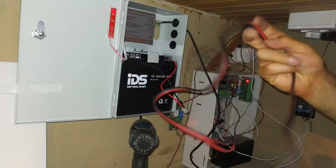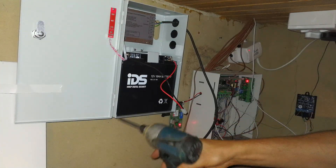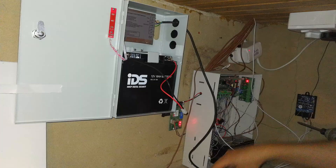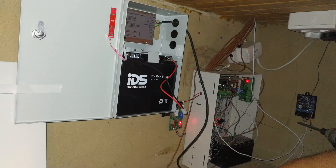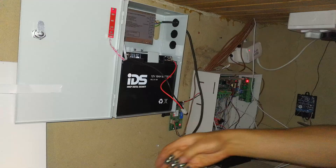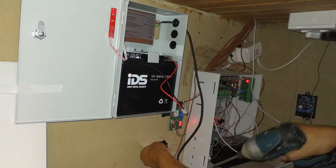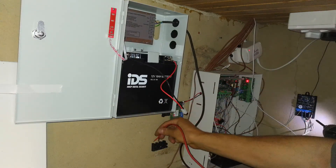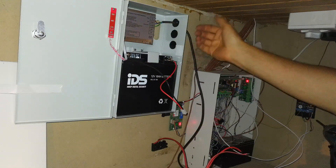Before I connect that up, I'm also going to wire the 12 volt output — this is going to be the supply. I drilled a separate hole earlier, and now I'm going to put a terminal block there and insert it into the wall. I'll screw it to the wall just there. This can then be wired directly to the devices. It forms a kind of accessible terminal point, because you don't want lots of wires coming into the power supply unit itself — you want it accessible near all the devices.